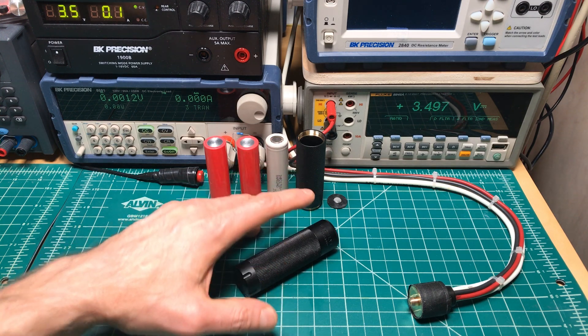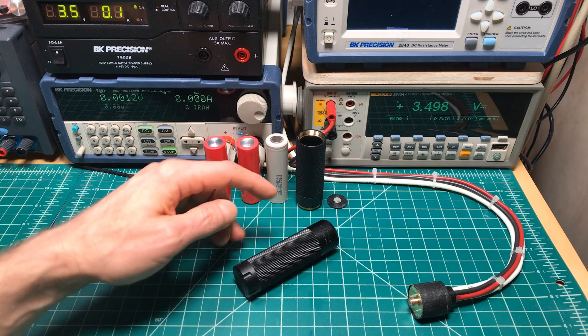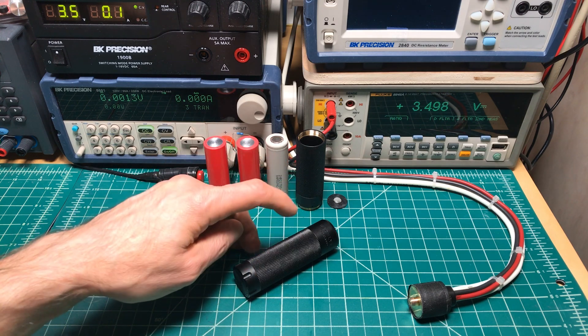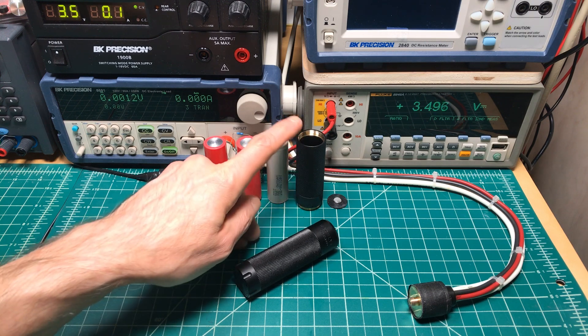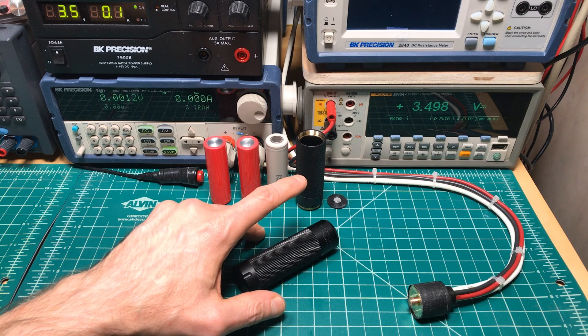This gives us a chance to see how consistent it can be. First time around I got 0.09 volts, 0.089 volts for a single and 0.125 for double — we'll see what happens this time. Arcing damage was there and you should probably clean it every two to three hundred presses.